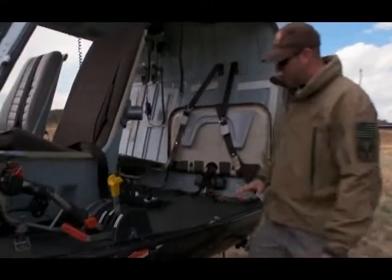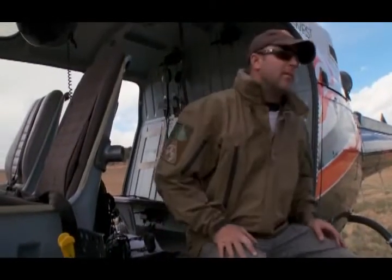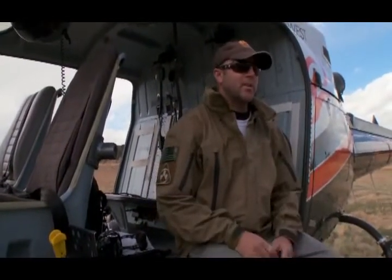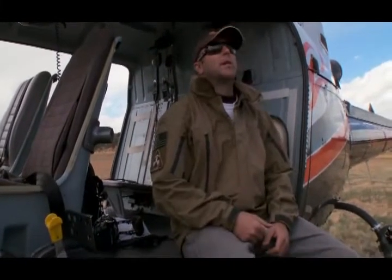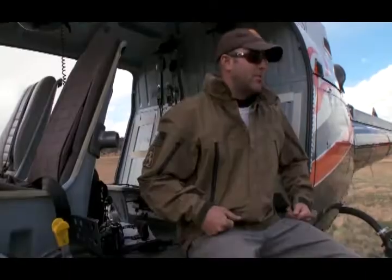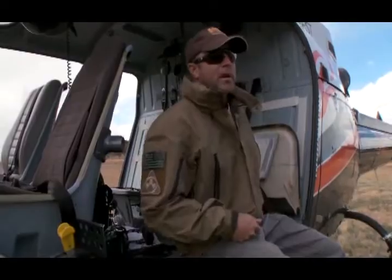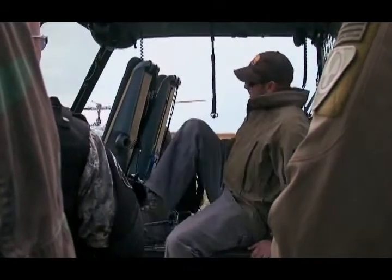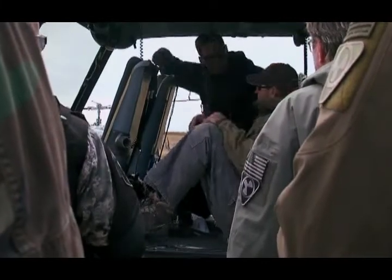The harnessing, the shooter will be sitting here on the edge, obviously, and you're gonna be rigged in. If we do happen to go down, crash position is gonna be get back inside the helicopter. Front seat passenger cameraman, you wanna lean back in your seatbelt so the inertia reel lock locks you into place, okay? For the instructor and student, if we're going down, I'm gonna let you know over the comms. You're basically gonna tuck yourself back inside here and just brace yourself up against the back, okay? In that position there.